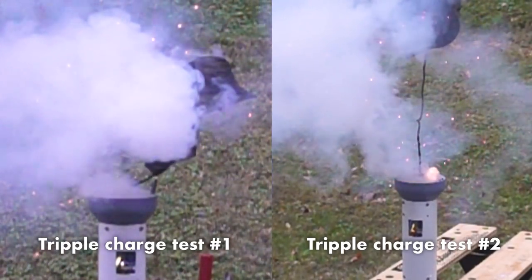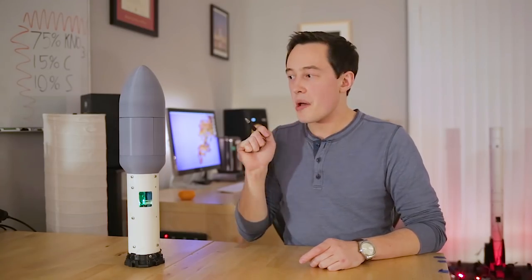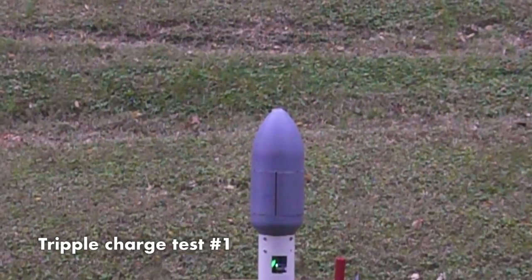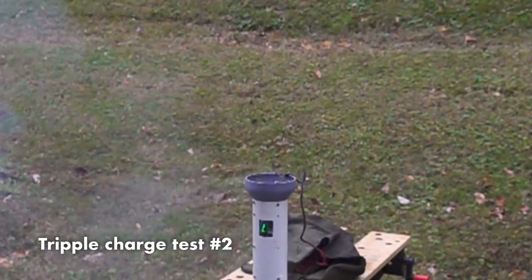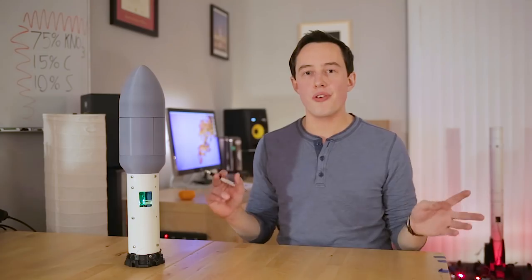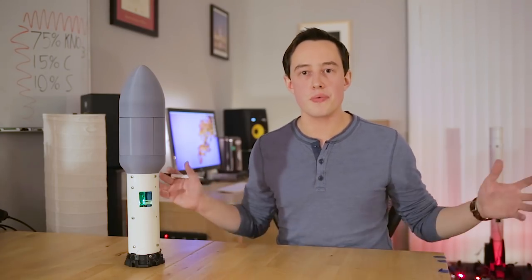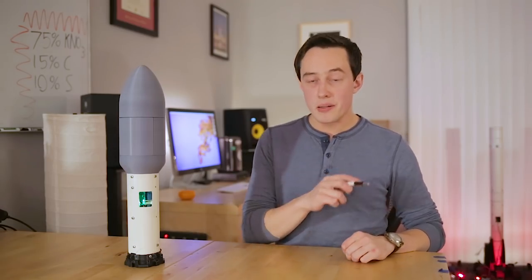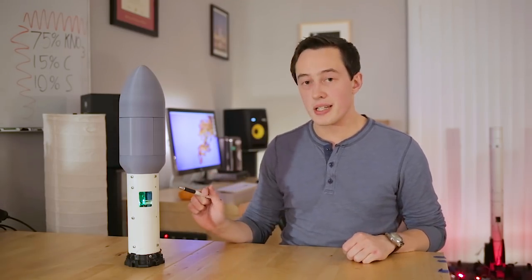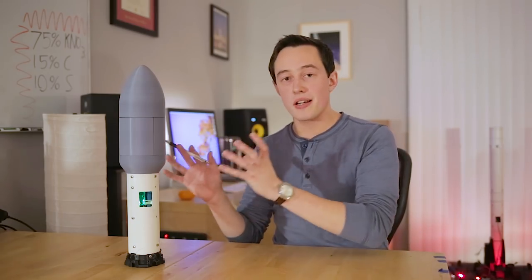A quick side note, one thing that's hard to get a sense for here is speed. Let me show you some clips of this happening in real time. That's it. Everything happens super fast, and you can see how having this high-speed footage really helps diagnose how all of this works. Something else that's cool here is that there's about a 20 millisecond delay between the time that the signal sends current into pyro channel 1 and the time that gases start to be generated inside the fairing.